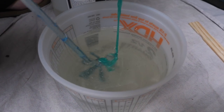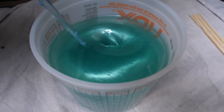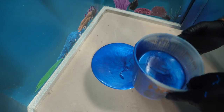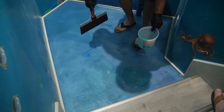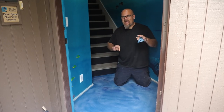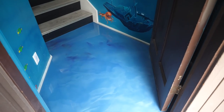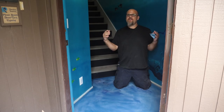I have one more color — our blue-green metallic powder. We're going to add just a tiny bit of that in the final clear coat, that flood coat, and that's going to give it three colors. We started with our Crater Lake blue, then we did our Blue Earth, and we'll finish with our blue-green. You can see the walls were fogged with some blue-green — they look blue-green, and that's really going to match, giving you depth into this floor with three metallic colors. Pro tip: if you're going to do multiple seal coats, just add different colors of metallic and you'll get a floor that looks like a pro dominated that project. That's how you go from good to great.